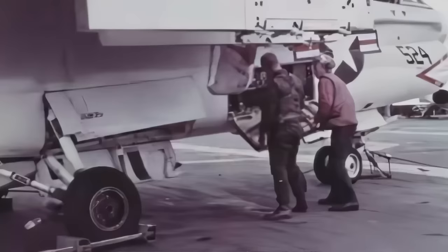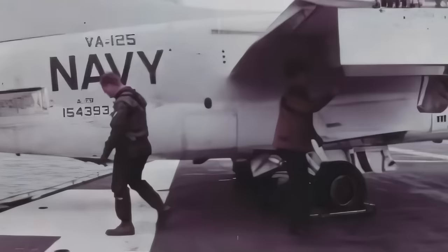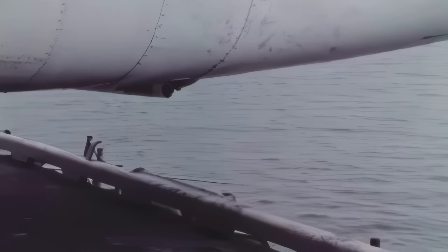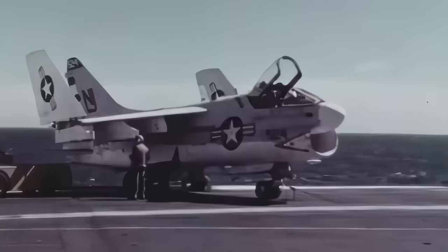On deck, conduct a normal pre-flight. Inspect tires for cuts and bruises, struts for proper inflation, hook point for grease, and look for possible cable damage to the underside of the aircraft. If the aircraft is spotted with the tail over the catwalk, it may not always be possible to make a complete inspection of the aft fuselage. Mark the gross weight of the aircraft on each nose gear door.